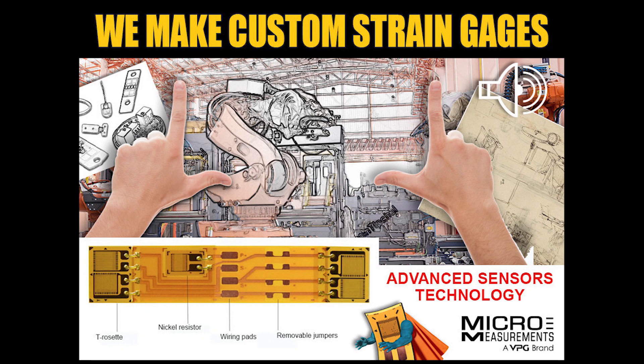What they'd like to do is measure axial and torsional loads, and we're looking at developing a custom sensor through our Advanced Sensors Group. This is a relatively new part of our company that, using a new technology, can make strain gauges that are much smaller and also much higher in resistance than we could ever before.